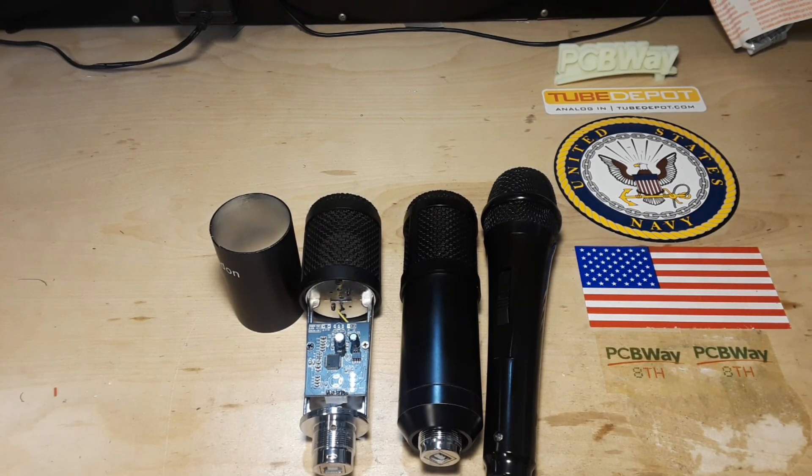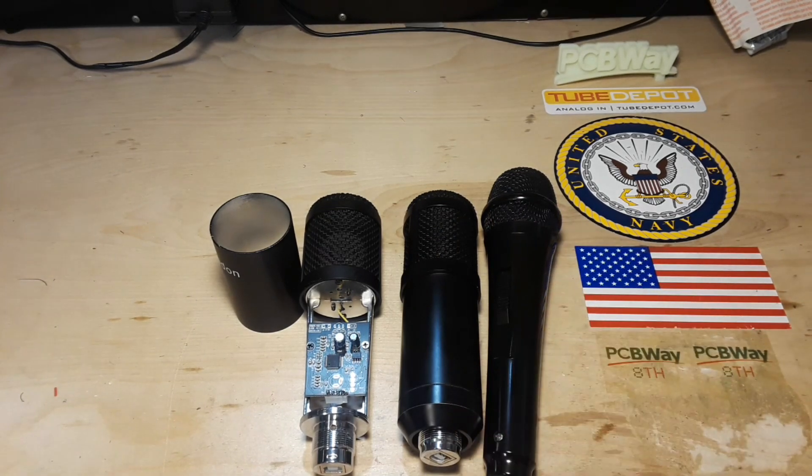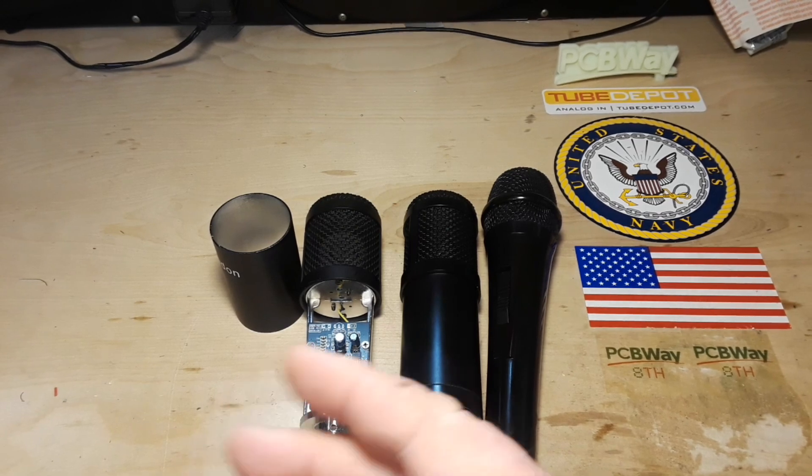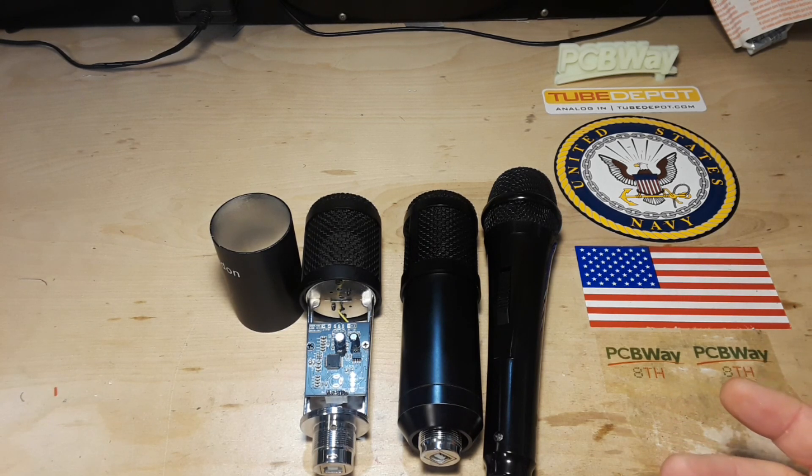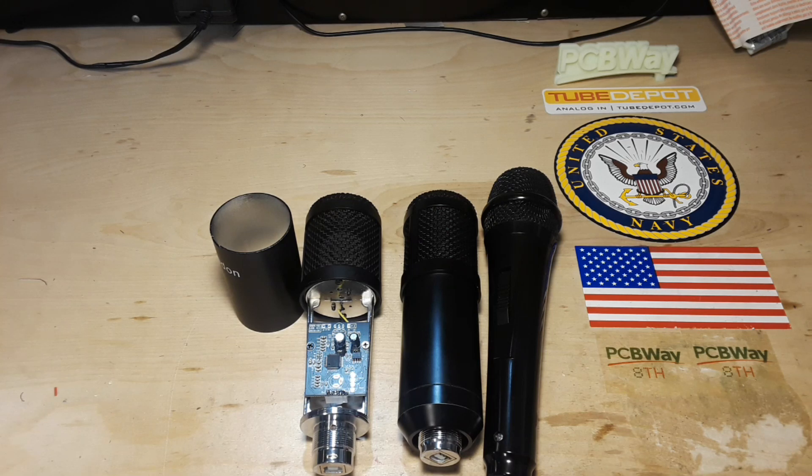Now you know a little bit about the two different kinds of microphones — the condenser and the dynamic. The condenser has less mass to vibrate, which makes it a more accurate representation of the sound, but it's a delicate microphone and requires generally 48 volts of phantom power. The dynamic microphone has to move a thicker coil, so it's not quite as accurate, but it's fine for most things. The number one vocal mic on stage is the Shure SM58, which is simply a dynamic microphone. It's sturdier, heavier, just a little bit slower — and when I say a little bit slower, we're talking nanoseconds. Maybe a trained audio engineer will notice, but some people have very specific wants in their sound.